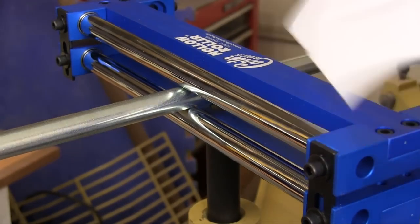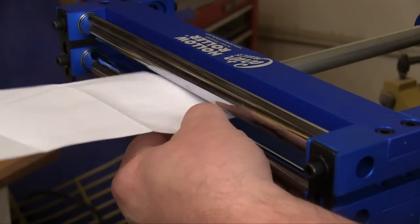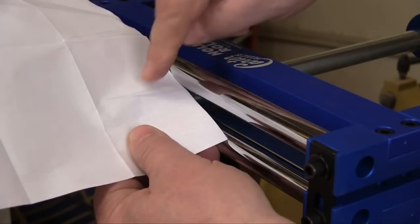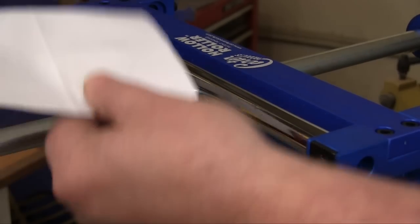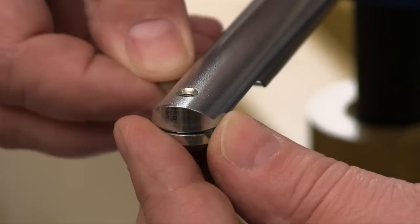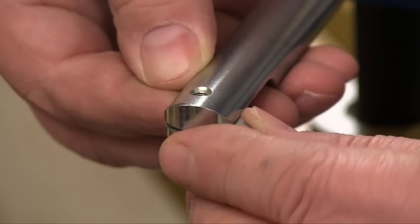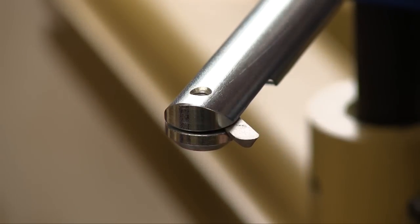The rollers are set at the factory but you can check that setting by putting a plain piece of paper on top of the bar and then pulling the bar and paper back and forth through the rollers — the paper should just fit. Now we can install the carbide bit; the instructions say to start it at a 45 degree angle and that seemed to work pretty well for me.